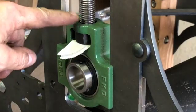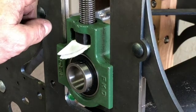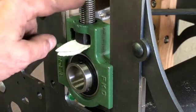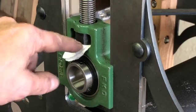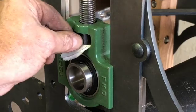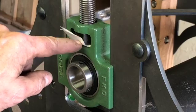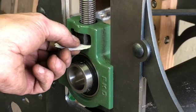What I did here is I inserted the nut and turned the threaded rod all the way into that nut, and I've put a piece of paper here. Remember that the bottom piece of this threaded rod is ground a little bit round, so it's pinching the nut in between. To make sure there's minimal play in this area, I've just put a paper there as a spacer.